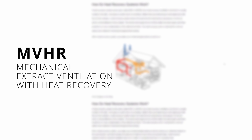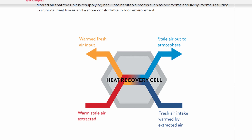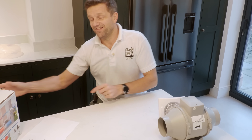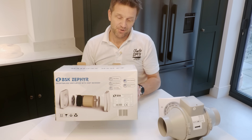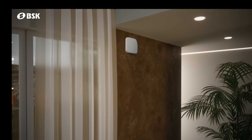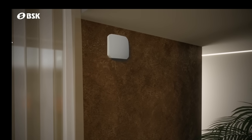You can add another element to centralized systems when you talk about heat recovery, because these big air handling units typically have a heat recovery element. In short, the heat is taken out of the warm air being expelled and is put into the cold air coming in from outside. Some systems go a step further with an additional heating element so you're not losing any heat at all. That's all well and good for new build systems — but we can't do anything like that in our old properties. Wrong! That's where today's installation is so interesting, because systems like this are decentralized ventilation systems but with the added heat recovery you normally only get from those more sophisticated centralized systems.